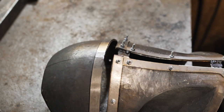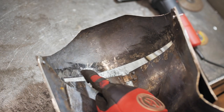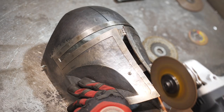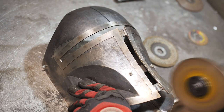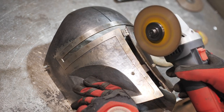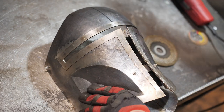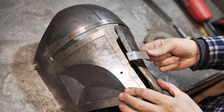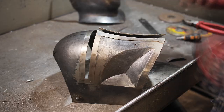The holes of the bolts are welded on the inside and outside, and also polished with the angle grinder. It's time to remove the temporary bars in the vertical gap. But I've decided that I still have to add one bar that will stay on the finished helmet. Without it, the cheeks of the visor are moving too much and that can lead to the distortion of the symmetry.